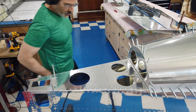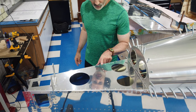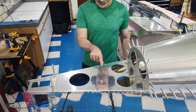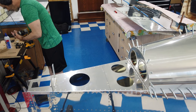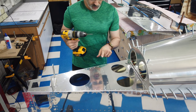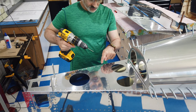I'm going to demo showing what I was talking about with getting holes drilled nice and perpendicular. I've already got this one started but I'll show you the process — you can pretend that this hole doesn't exist, it's only a center punch hole. We'll start from scratch. I'm going to put the drill bit into my drill and drill into that center punch just a little bit, just enough for the drill bit to find its way into the hole.